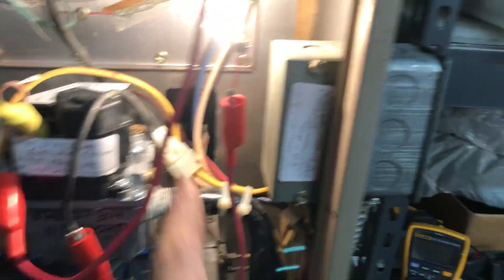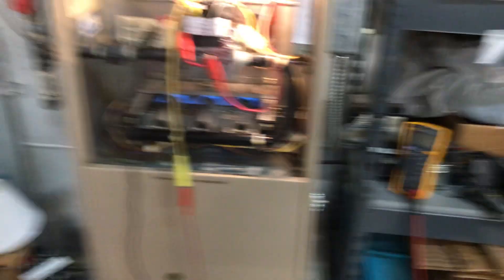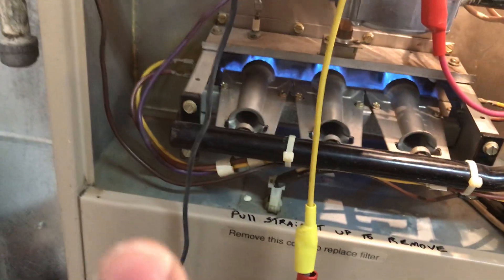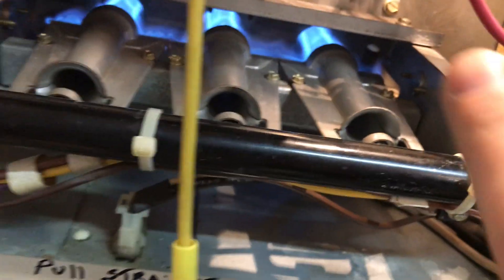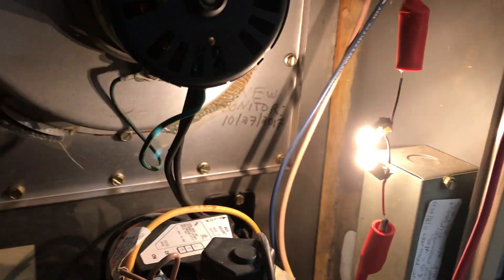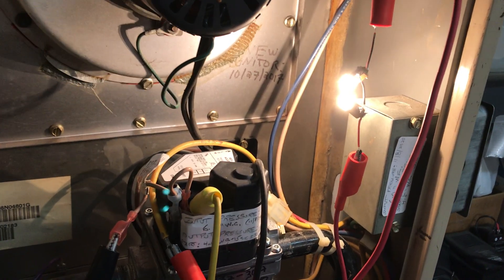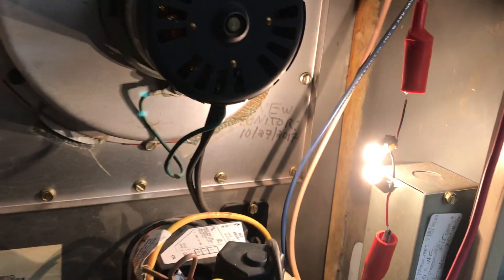So what we don't know is what's causing that. I don't think it's the flame sensor, because if the flame sensor were to go out, it would cause a re-strike — a re-strike would mean a recycle. It would detect no flame, and then it would start the hot surface igniter, which you don't see lit here. So there's definitely something in the controller. I'm thinking it's one of those relays. I may take the control board out and change the relay. But clearly I saw some disruption in that current that would normally drive the solenoid or the gas valve.